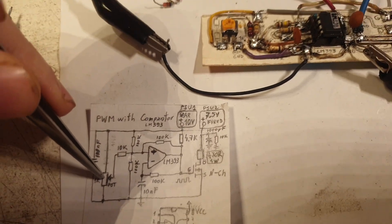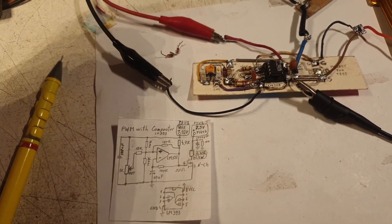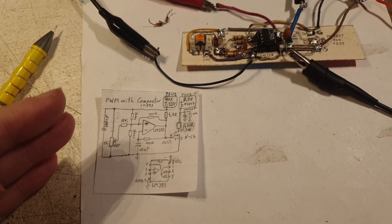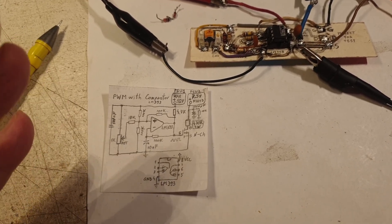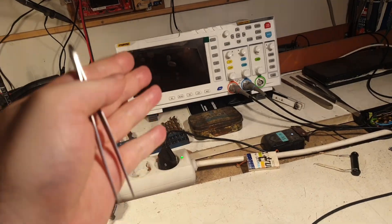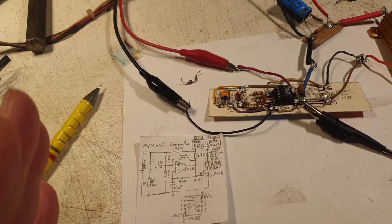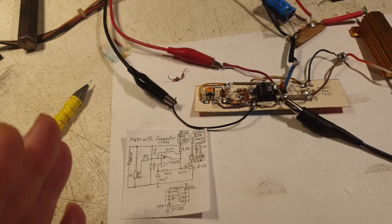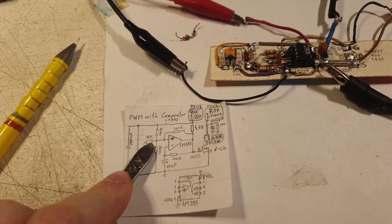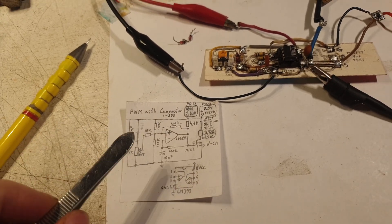I also changed the potentiometer to a 10K, hoping to get from 1% to 99%, but it didn't work. Every time I changed this 10K resistor, going lower made the circuit extremely unstable below 10% and above 88-90% — very finicky, very trembling on the oscilloscope. Even at 12-15% it was still influenced by that instability. After 15% it was smooth and linear up to 85-88%, so I gave up changing this resistor.